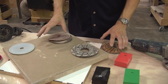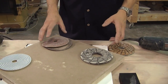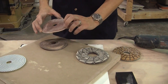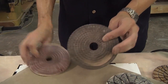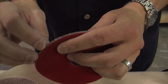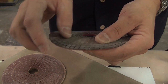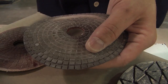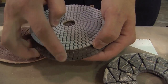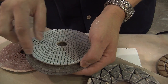I have a variety of different competitor's pads that I want to show you. And although they're good, relatively speaking, some of the characteristics are not so beneficial to you. These style pads right here start out very thin — this edge here is practically brand new, and you can see how thin it is. So you're getting very little diamonds. Look at that — it's twice as thick. And look at how narrow these slots are in comparison. One third as wide. So the little pads that have the diamonds in them, they're larger, yes, but the spaces in between are very narrow.